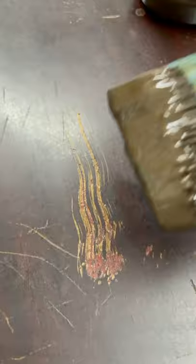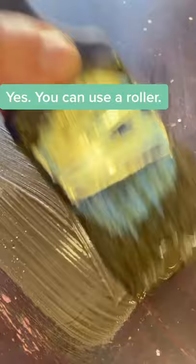I apply it really thick in the places with the deep gouges, and for the rest of the table I put it on and spread it out with a really thin coat just to smooth everything out. When it dries it's pretty much rock hard, but you can still sand it a little bit to get it really nice and smooth. For minor imperfections, one coat's going to do it. If you have deep gouges like I do, you might want to go over those spaces a couple more times with a heavier coat.